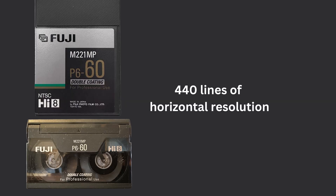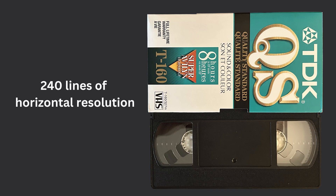For the third and final test, we're going to do something different. The Hi-8 tape can capture 440 lines of horizontal resolution, as seen in the first test. Now I want to test using a VHS tape, which only has 240 lines of horizontal resolution — testing the comb filter versus the S-video cable. On the left is composite out from a VHS player, in the middle is S-video out from a VHS player, and on the right is the ES15's comb filter doing its thing.